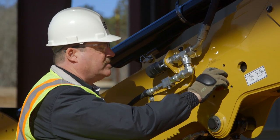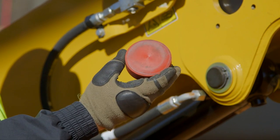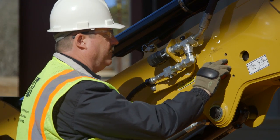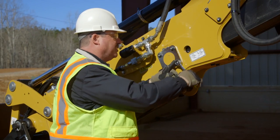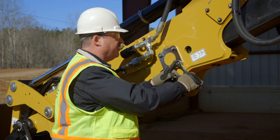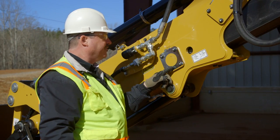Remember that our pucks are impregnated with a lubricant, so they don't require grease. After removing the final shim, put the cover back on and replace the four bolts. Remember you can store the shim on the outside for future use.